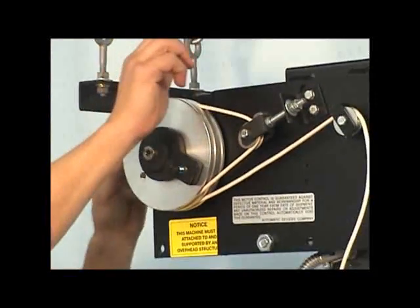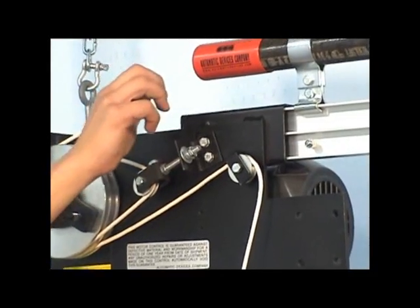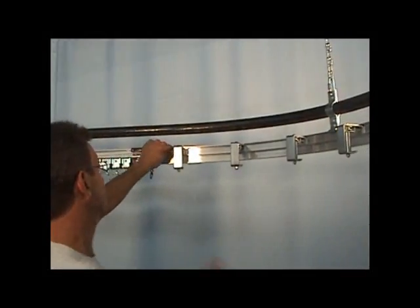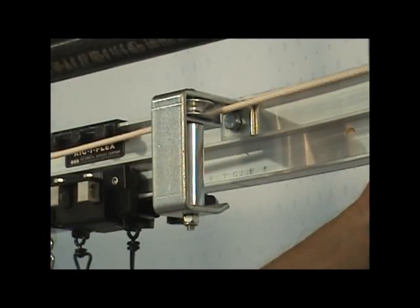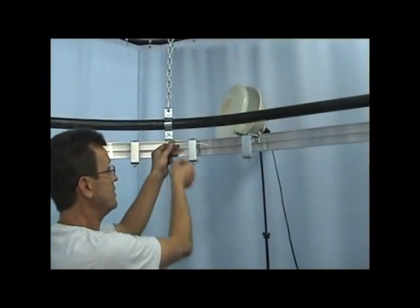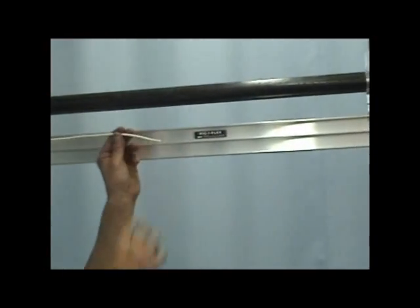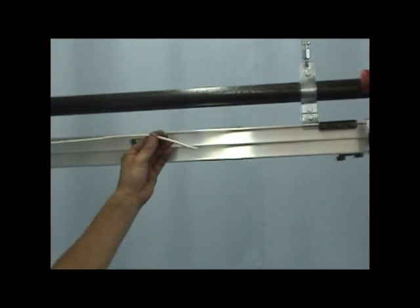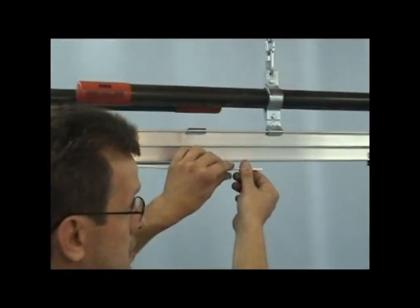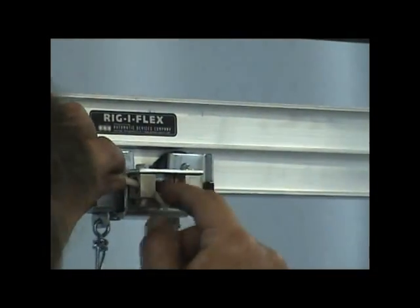Continue the cable around the drive wheel and towards the track. Next, pull the cable towards the 1458 spindles and thread it between the upper wheel and the cable guard of the 1458 spindles. Continue threading through all of the 1458 spindles towards the track center overlap. When you reach the overlap, thread the cable through the inner or dead end end stop and into the closest cable clamp of the dead end master carrier.